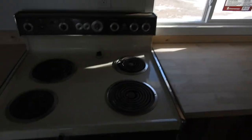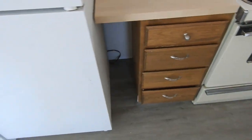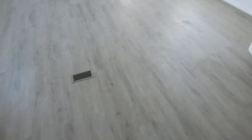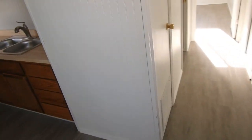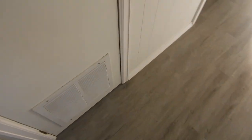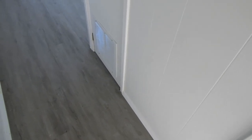Brand new kitchen window. They're going to replace the range and the fridge, I'm sure. Just left that little cubby for them to put a garbage can. This whole entire floor — we put subfloor down first, tongue and groove all the way from one end of the trailer house to the other end. We just notched around that wall and notched around the pantry. This is all new framing where the furnace is. We put a vent in front of that door now because we covered up the old cold air return — it was just leaking lots of cold air in. So now the new cold air return is that big vent in the front.